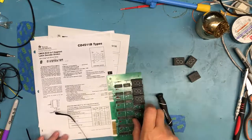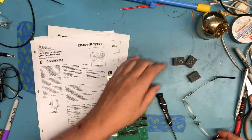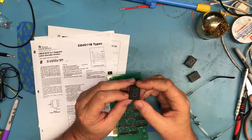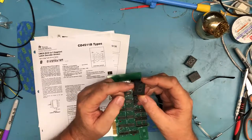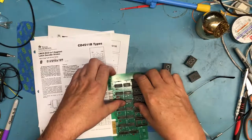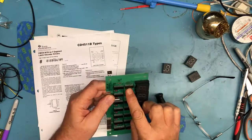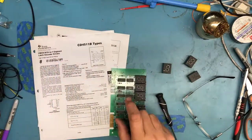The R is a good hint that it's a resistor network. It's really common with seven-segment displays to have a resistor for current limiting for each one of the segments. So I thought at that point, odds really good, this is a resistor network. Grabbed the handy ohm meter